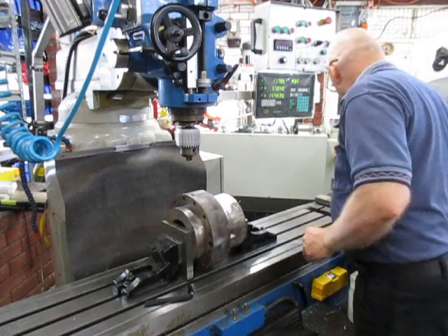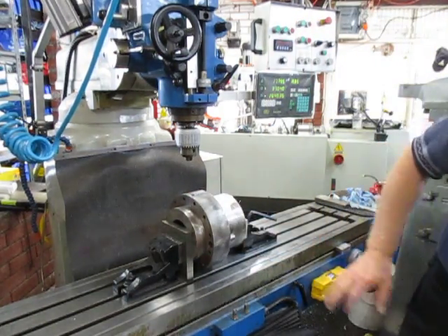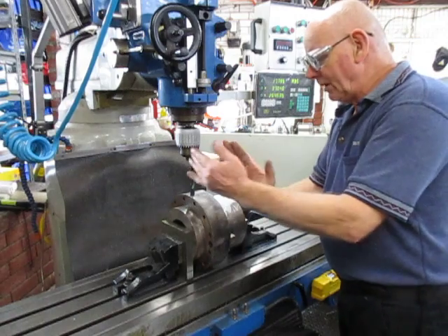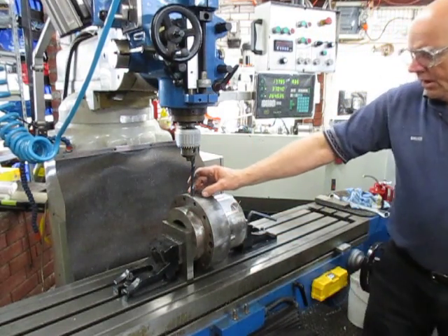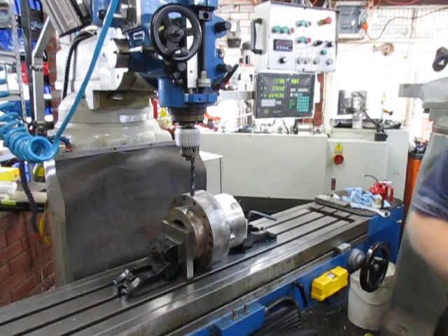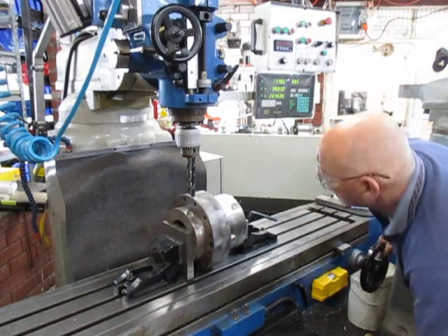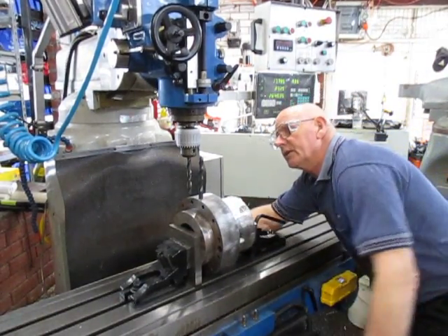Going for tight - that's all good. Now we'll be able to lock those jaws down. But first of all we want to line this up. The way we're going to do it is I've found the 12.9 drill bit seems to fit in there nice and neat. I'm going to fit a drill bit in here and line the two up in both directions - really only in that one direction. And then I'll know I'm pretty spot on as far as the line up of the hole is concerned. Just grab any drill bit, you can use a dowel pin or whatever. We'll bring them both to a point where I can line that up and then lock this into place for actually doing the job.